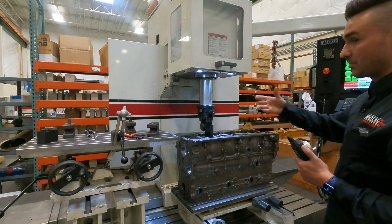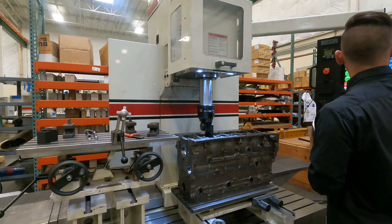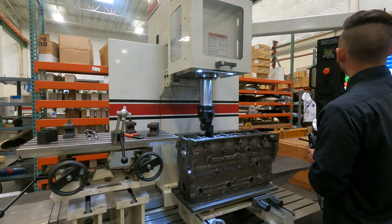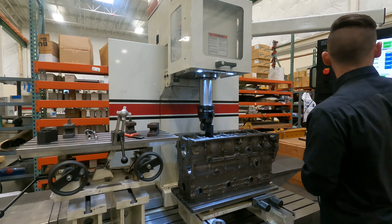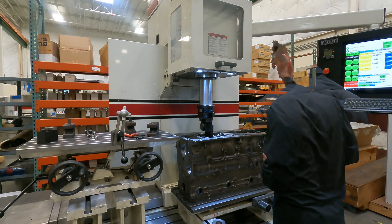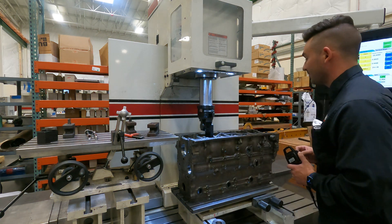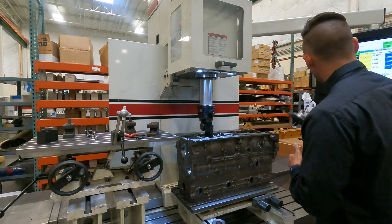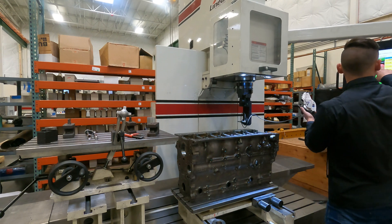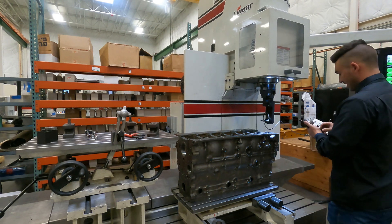On this side we're moving the axes, so we'll just adjust. I need to move by about a thousandth of an inch. I'll grab my Y feed and just move in. Zero and four tenths on the other side — half a thousandth, I'll accept that. If you want, you can go back after you've done that adjustment. Make sure you set your Y zero however you change it, and you can come back and check this one again.